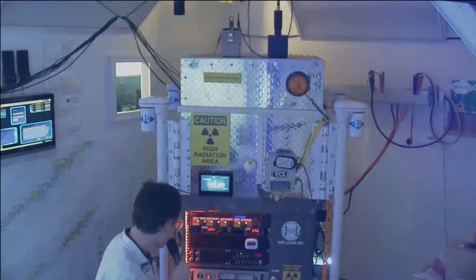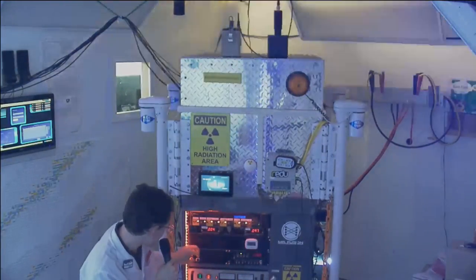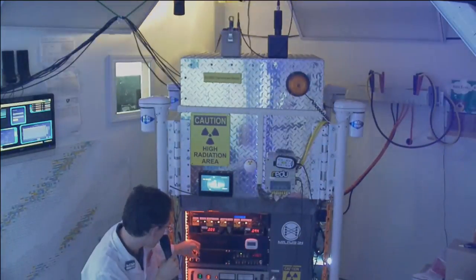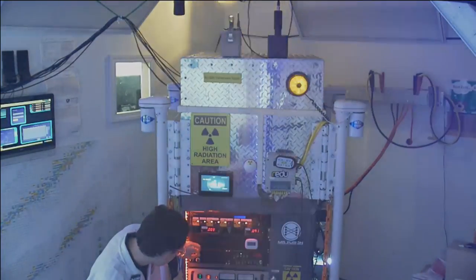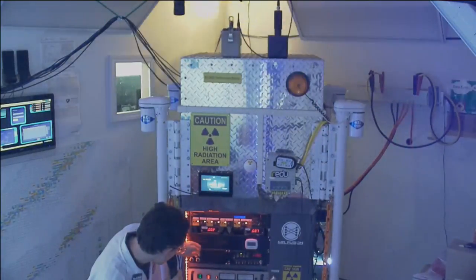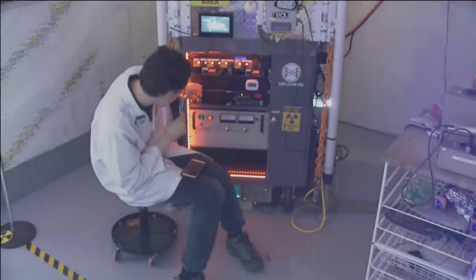We'll find out. So, once again, we're in constant current at 5 milliamps, so I know I've got some room to go ahead and start increasing my voltage again. So I'm going to slowly start to take down gas flow. And as gas flow starts to come down, we're going to see that voltage is rising. We're passing through 35,000 volts, 40,000 volts, 45,000 volts, 50,000 volts, 55,000 volts. And I'm just going to let it run there for a bit.